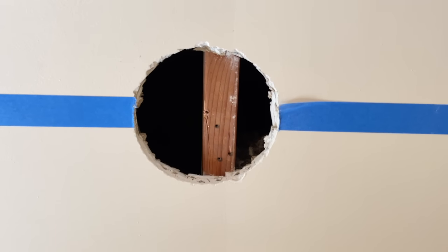Now you're ready to start cutting those holes for each of the recessed lights. I use this purpose-built recessed light hole saw made for drywall — it has carbide teeth spaced out that are really good at eating away drywall. One thing to consider: if you have a ceiling joist running through the middle of your hole, you do not have to worry about your layout with ultra-thin LED recessed lights because they fit flush to the ceiling whether or not there's a joist through the hole. But be careful — as you finish the cut where a joist runs through, the teeth can grab and bind your drill or damage your ceiling. Just take your time at the end of that cut.